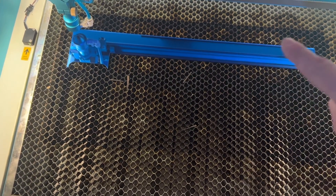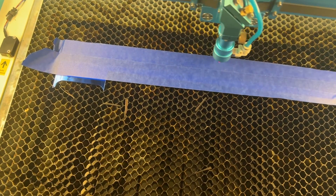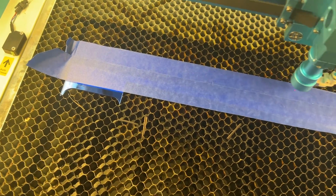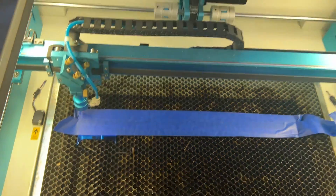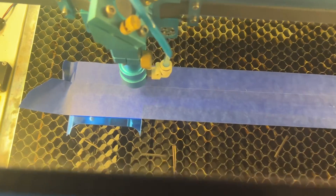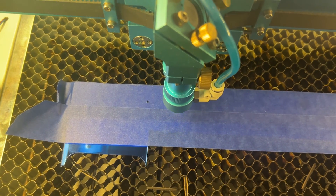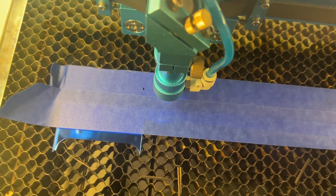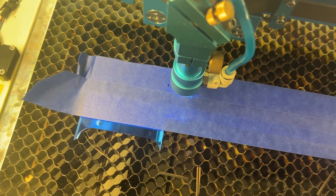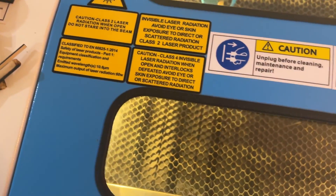I've placed my piece of acrylic in the laser — I'm using blue mirrored acrylic, just a scrap piece, which is perfect for this project. Make sure you use masking tape with acrylic because you definitely don't want laser burn marks in it. Same as with the wood, overlap the tape an eighth of an inch, press Start, and the laser will go ahead and cut out the acrylic.